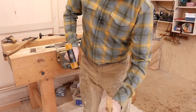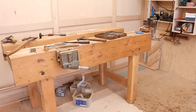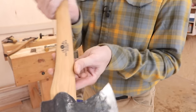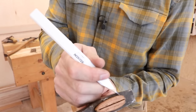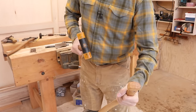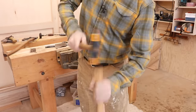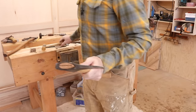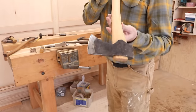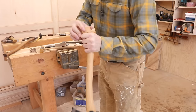Let's see here. We want to really seat it. Here's a trick I use to know when you've gone too far — and you can go too far with this. I've gone too far before and actually split it, usually on the front right here where it got too tight and actually split. So I'll put a pencil mark around it like that, and then you've got a frame of reference. You can see if you're continuing to drive or if you've just reached the limit. It's still going — we've got a 32nd of an inch right there. It's fitting in there nice, really getting tight against the cheeks, but I don't want to split the handle either.